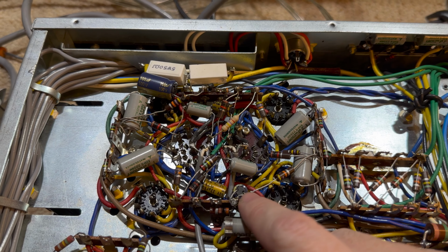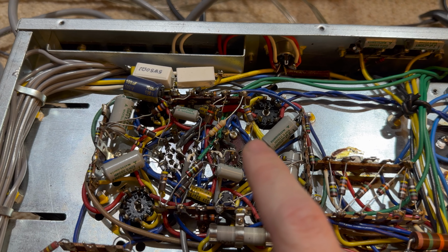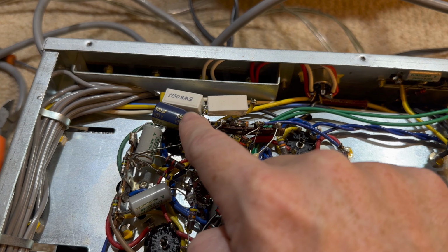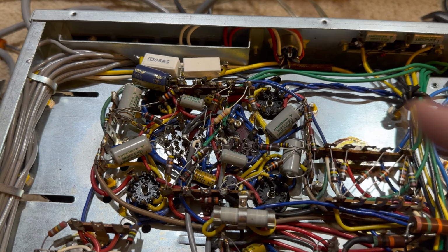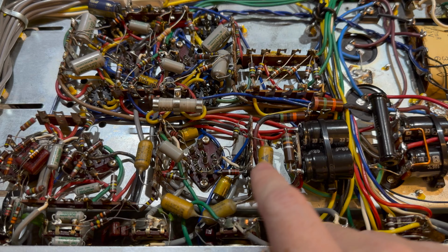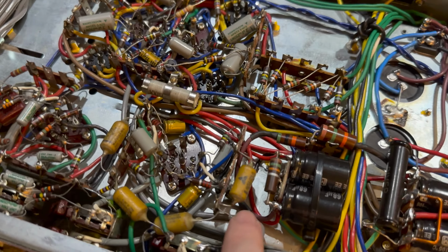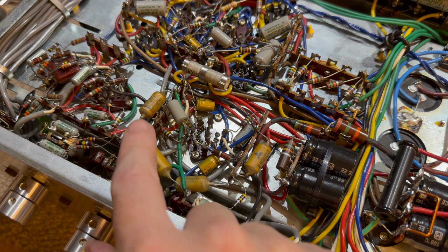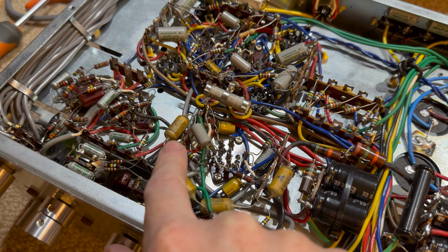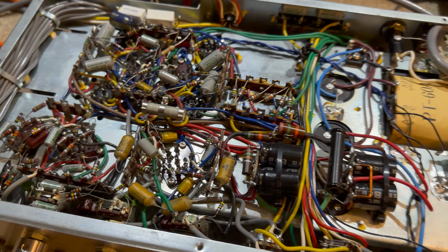This one's a smaller one, but there's only about 20 volts across the caps. So that one's way over spec, but I didn't have any more 35 volt caps, so they're the same. But yeah, anyway, I'm waffling on. These capacitors here, I didn't realize are actually paper capacitors, wax coated. Never really seen them before. I took one out of circuit. It seems to test okay, but I don't have an ESR meter that can read this low. So I may change these in a future thing.